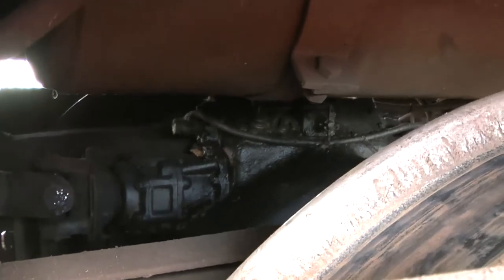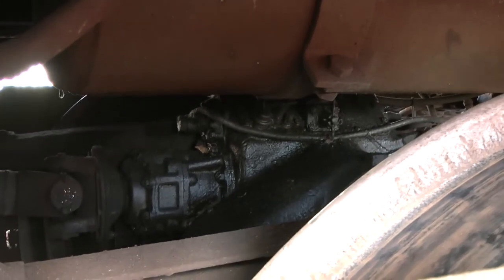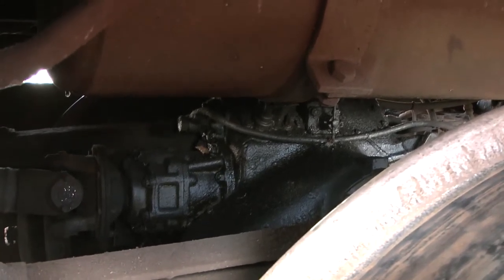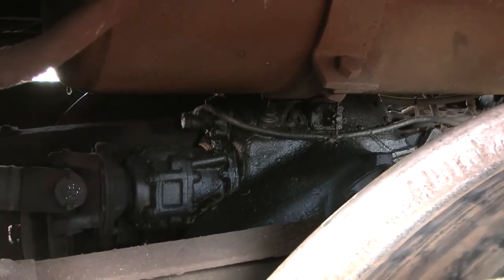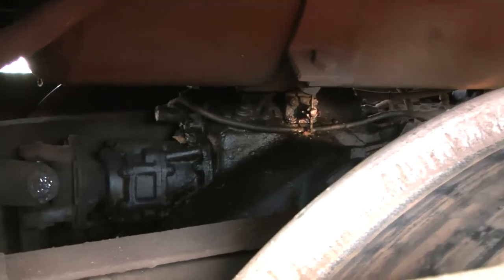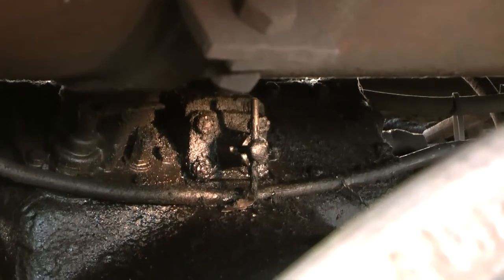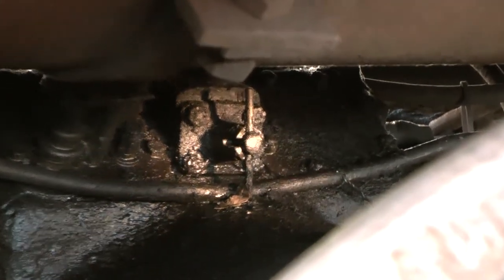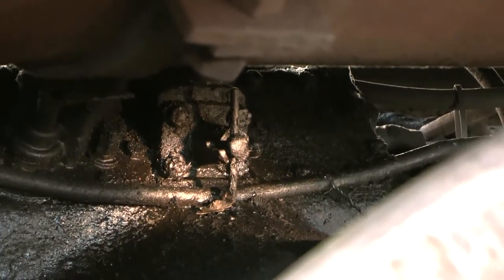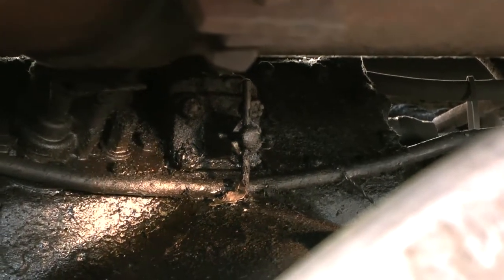If an engine stops, we can't get it started, we've got to isolate the final drive, because if we don't isolate it, it has happened, the wheels are still turning the gearbox and it overheats them and seizes them up. So we have a big long rod with a hook on the end. Can you see that thing there that I have my light on? You hook that with your hook, pull it out, half turn it into them slots, and then you get in your cab and you move your reverser from forward to reverse, and as the piston moves along, when it gets into the middle, that drops into a notch. It holds it there so that the wheels can revolve freely and they're not turning the gearbox. And that's what we call it.